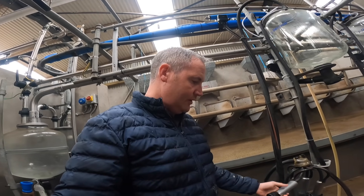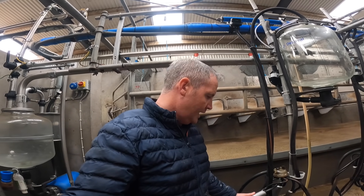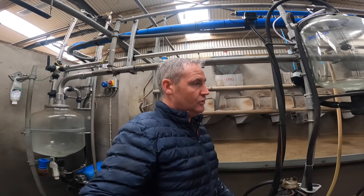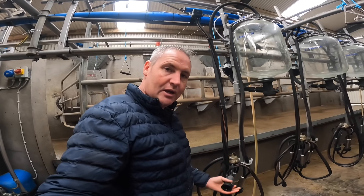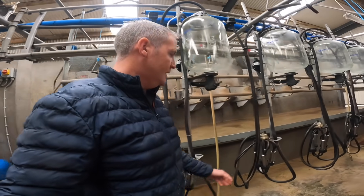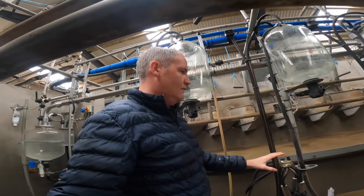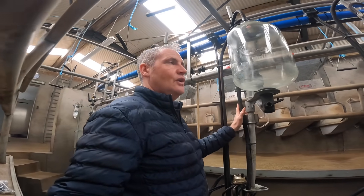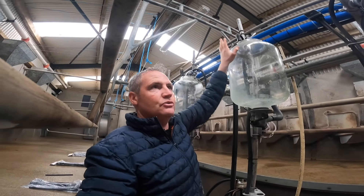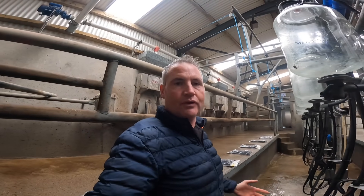You're going to get dirt and stuff that will embed into those cracks and that's the first thing that will actually make your milk quality drop. Every so often I bend a liner just to the side and if there's any water between the liner and the actual shell, I'd replace that — I'd know that liner was cracked or busted. That can happen as soon as a day or two after replacing them, or you can be lucky to get the six months. So every week I just bend them down and check there's no water between the two. I'm going to replace all of these, and then every year I come along and replace the main milk pipes and the main vacuum lines.